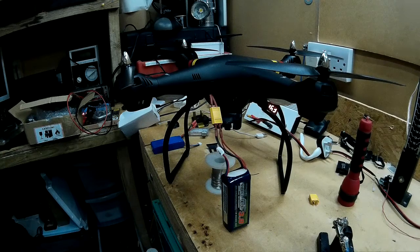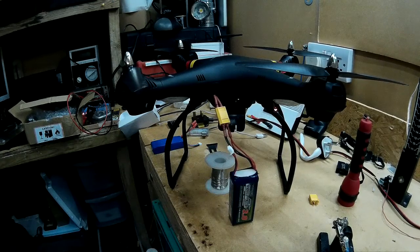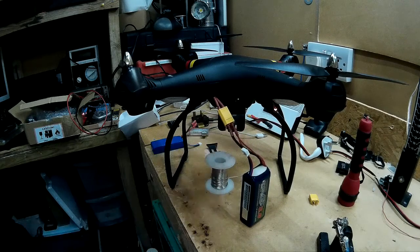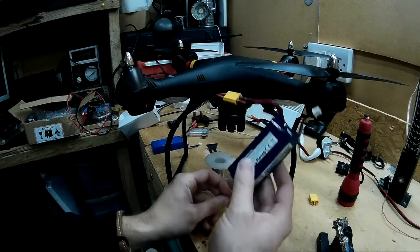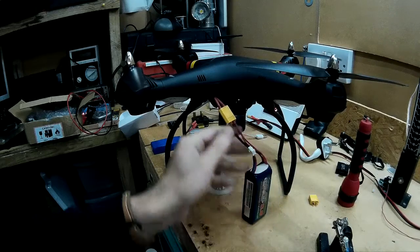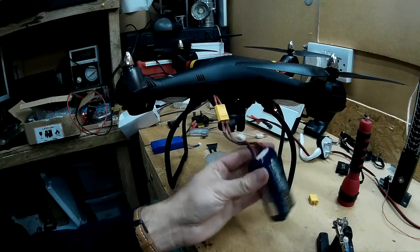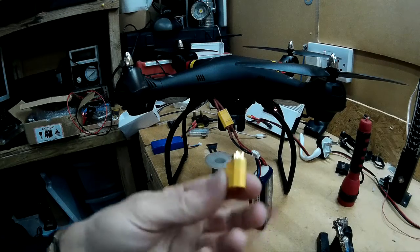Don't attempt this if you don't think you can do it, because I won't be responsible for any damage you cause to your Syma X8C. If you blow it up, it's your own fault. Mine works perfectly because I've been careful and took my time — that's all you need really, just take your time. Make sure nothing's shorted out, because if you short the battery out you're liable to either start a fire or the battery will explode. Be careful when you're playing with batteries, never short them out. I'll put a link in the description to where this battery comes from, and the XT60 connectors as well, just in case you're interested and want to do it yourself.